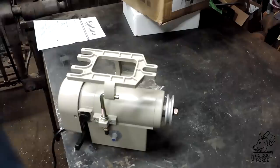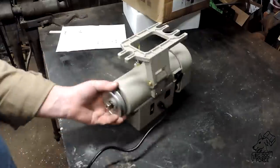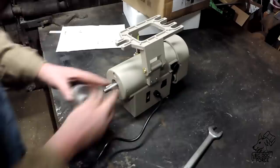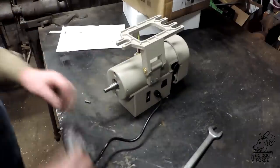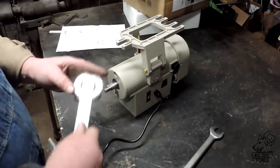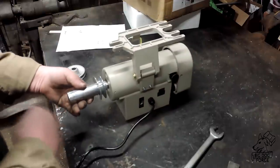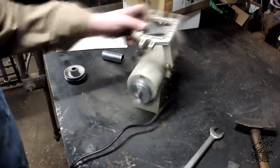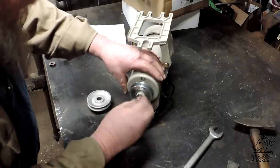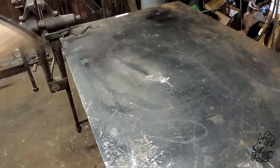What we're going to do is change that pulley out on the end — it's a little big, size-wise — because I want that gear reduction to be a little lower. I want this thing to have some serious torque so I can control that needle and where it's at. This pulley is about three-and-a-quarter inches, and I dug up an old aluminum pulley that was two-and-a-half inches. It's a half-inch V-belt which matches the 10-inch pulley I've got, and I machined the back of it down so it would fit onto that shaft with the keyway, just like the other pulley. I had to make a little spacer because the threads were a little longer on that shaft than the pulley was wide.